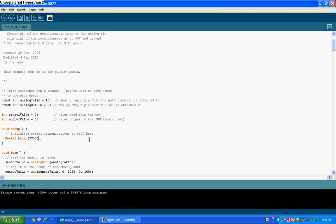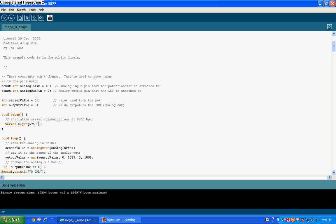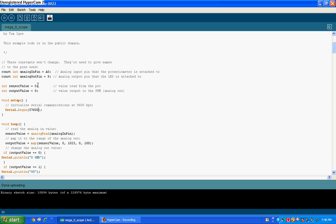Anyway, I'm going to go through and explain the code, and then after that show it working. So right here we just have the analog input pin — this is where you put your signal, to analog zero. Sensor value is the direct analog read, the number you get — 0 to 1023.